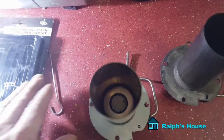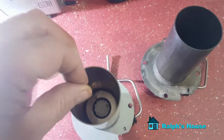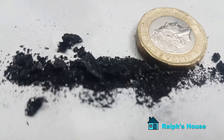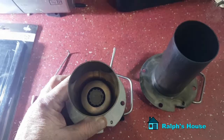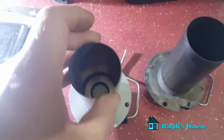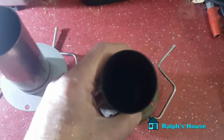In the end despite buying those picks, I found the custom wire tool was the best. You literally get it in there under the lip and just work your way round, crunching and scraping away all the carbon. Here's a picture of some of the carbon — that's a pound coin just for reference. I did that five times with the same amount of carbon every time. When you look down the glow plug hole you see that lip towards the end; the carbon builds up on that and the back of the burn chamber clogs right up.